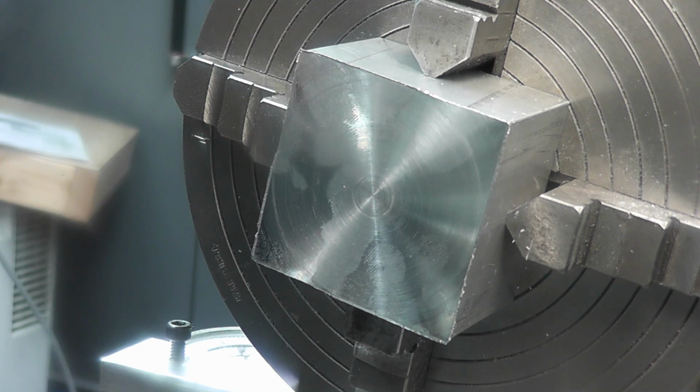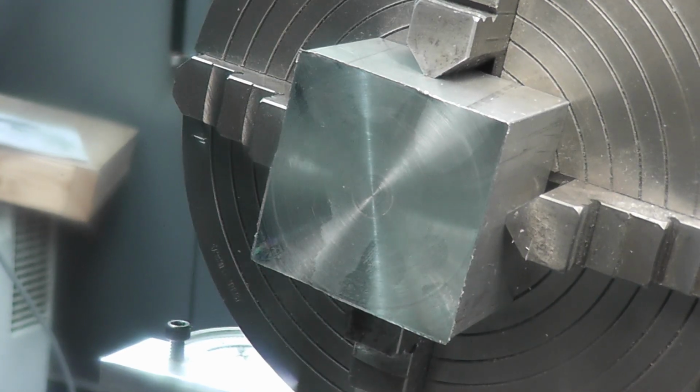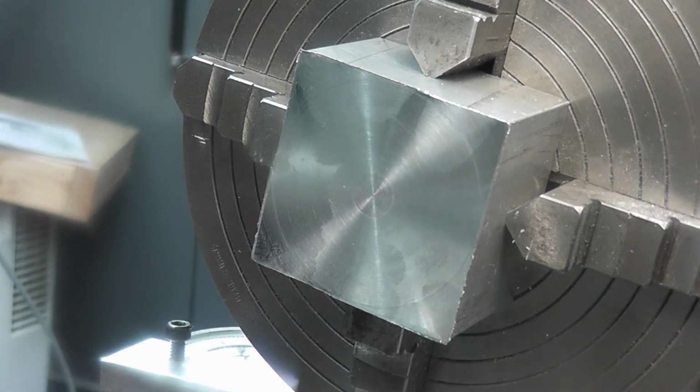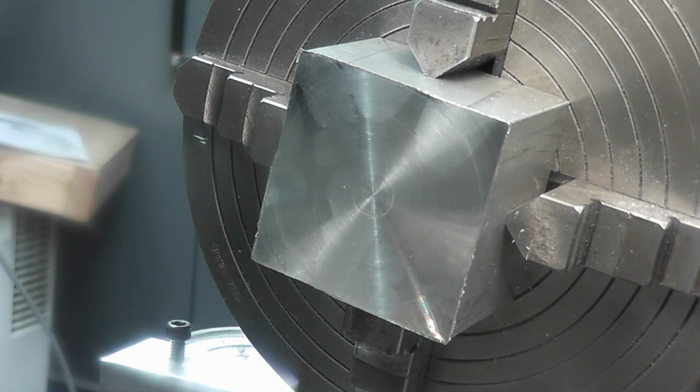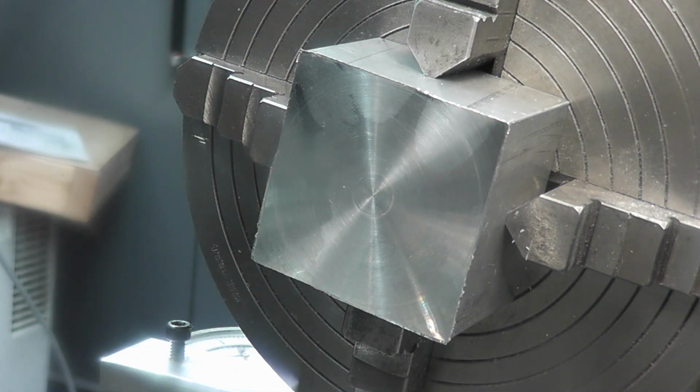Now, I know it's only a 1/2 inch hole, but I am going to step drill it. Like I said before, this lathe here doesn't particularly like drilling larger diameters if it doesn't have a pilot hole in there. Especially in aluminum, where it tends to get a little grabby, not necessarily grabby, but it tends to bind a bit. This lathe definitely needs a clearance hole through this.